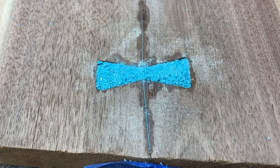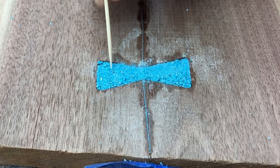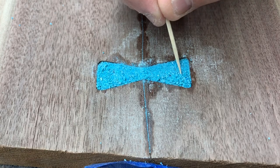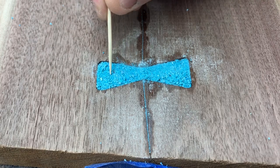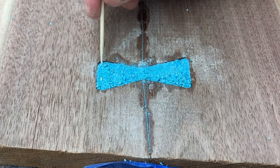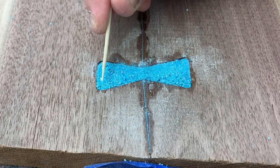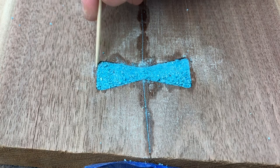So I've got a pretty good base here, but there's a loose spot — some light spots and low spots. The problem is I've got a couple of pretty high spots here too, and at this point, if I keep going, I'm just going to get out of control and keep getting higher and higher, and that's more material I'm going to have to sand off.